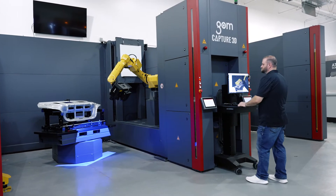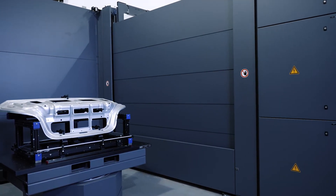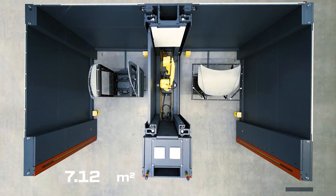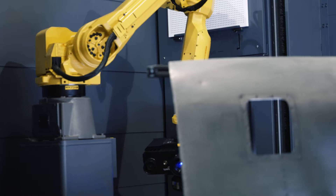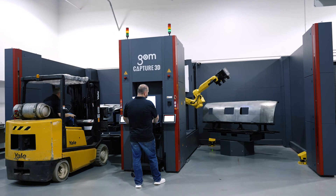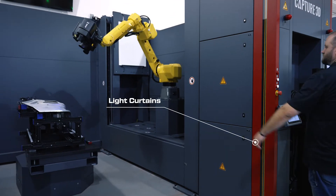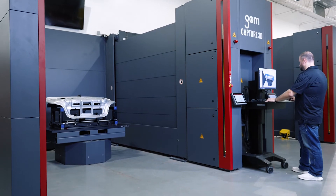Now let's take a closer look at the specifications and components of the 6235 ScanBox. The 6235 requires a footprint of roughly 35 square meters and is just over three meters tall. The 2.85-meter opening makes it possible to load parts via transport vehicles like a crane, pallet truck, or fork truck, and of course you can also load the parts manually. The entrance has built-in safeties with light curtains and floor sensors in each cell that detect entrance into the cell while the unit is operating and immediately stop the robot and rotation table.